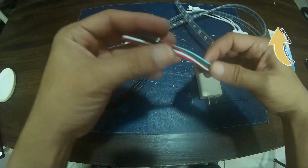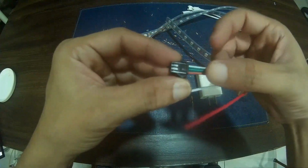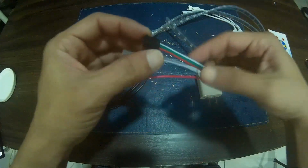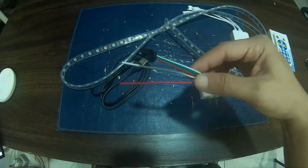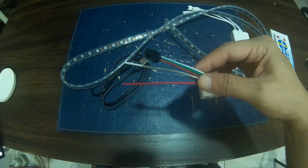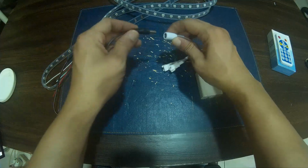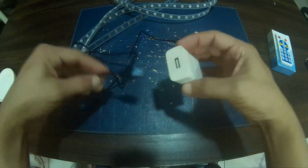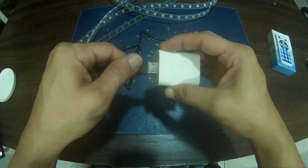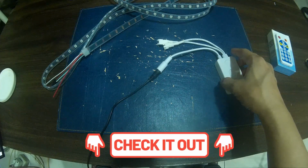You may also click on the info link on the right corner of this video to know more about the SP108E controller I reviewed previously. I'll be using a 5-volt ARGB LED strip that is already using a 3-pin JST connector, since the controller is only using that type of connector. If you have a different connector type, you might want to watch my previous video to know how you can convert it to a 3-pin JST connector. I'll put the link in the description box below.